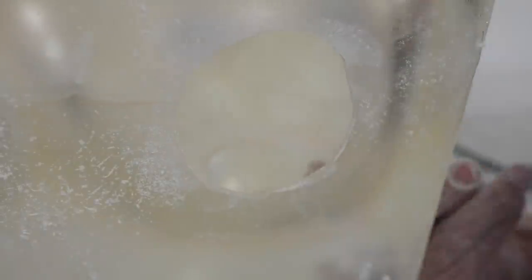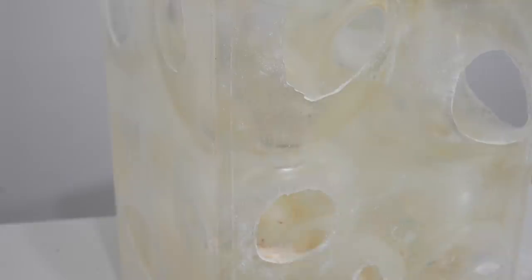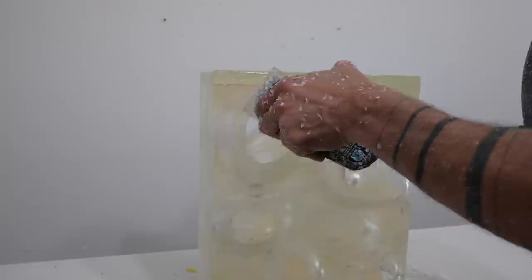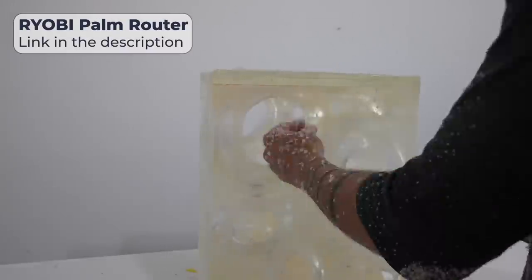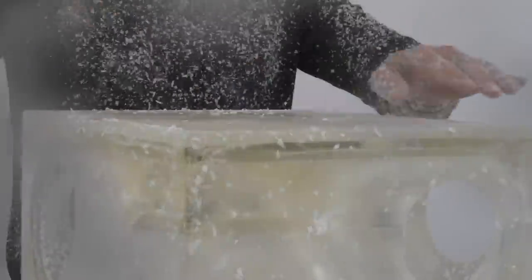There was only one knot I really couldn't reach with the rotary tool, so for that one I just used a hole saw and removed it as a plug. It's kind of cool that you can see inside through the walls and see exactly where to carve. I used my palm router with a round-over bit to smooth out the side holes, giving them a nice rounded edge and making the holes really uniform. I rounded over the top edges as well.